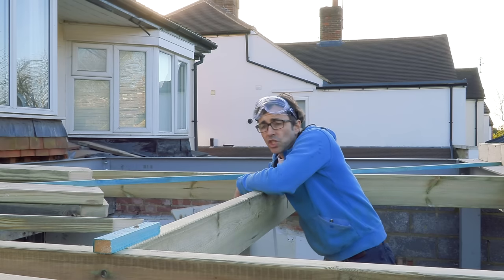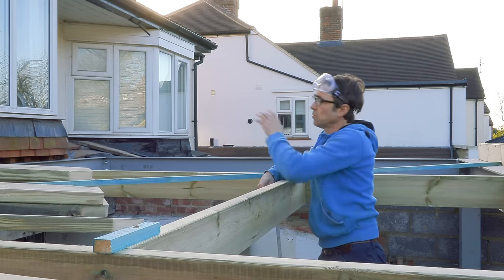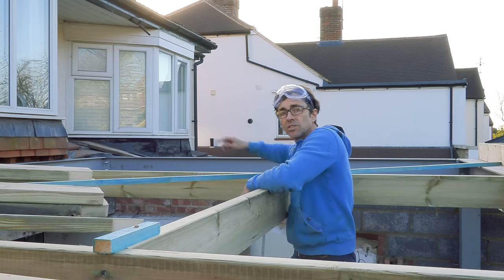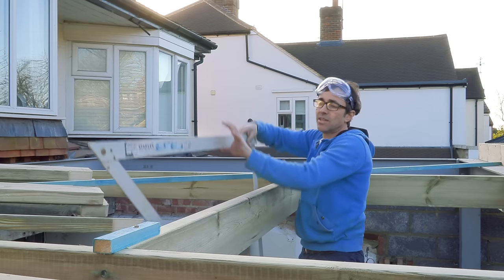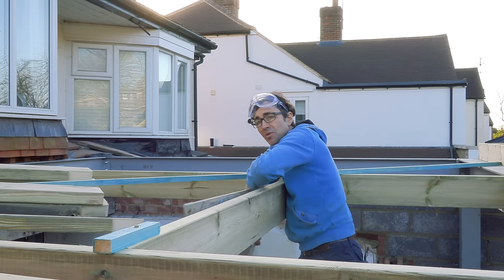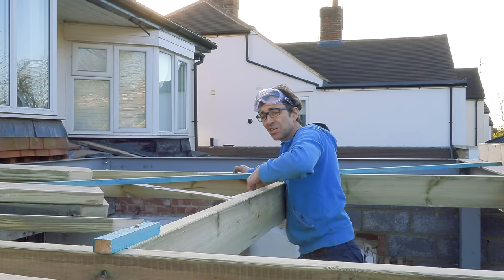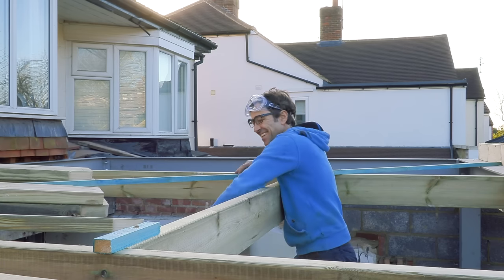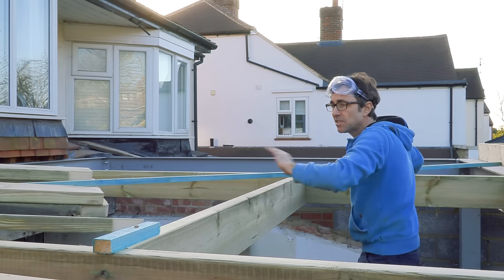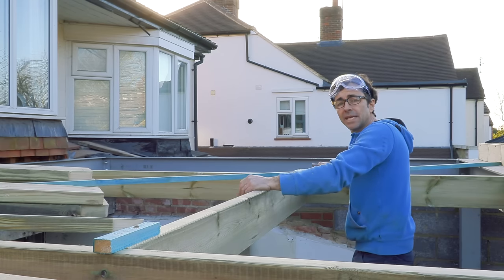We've created this large aperture — it's two metres by one and a half metres, and it's going to take a roof lantern. What you want to do is parallel everything up on the measure, then use equal measurements across the diagonals to get it exactly square. I always like to pick up a sight square as well to double-check. It's absolutely spot on — if the lantern doesn't fit, they've made it wrong. Let's rattle these last joists in, space them all out, get the solid noggins in everywhere, trim everything up, and that's this ready for furring pieces and decking.